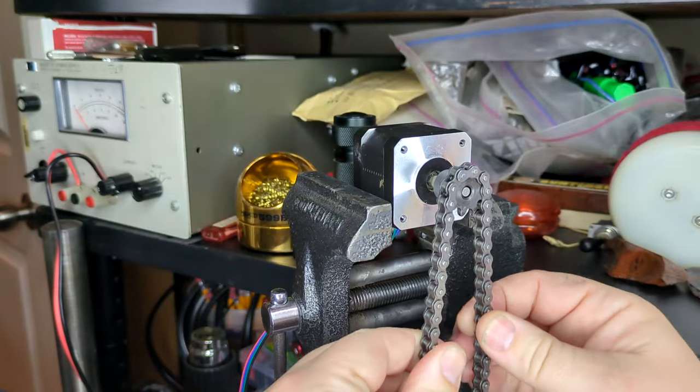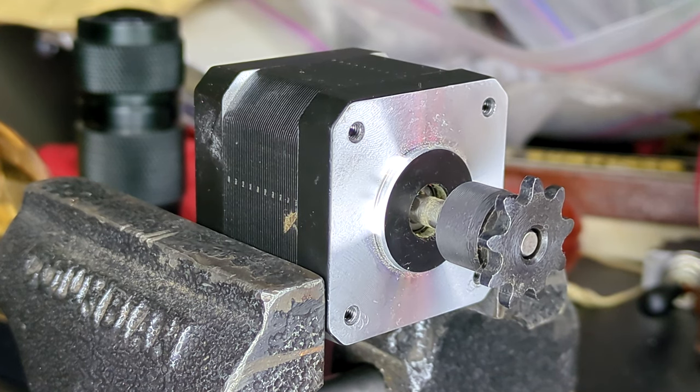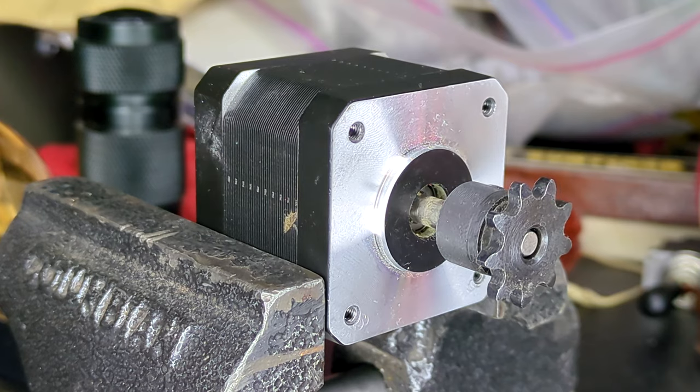Beyond just being pretty, roller chain would actually be ideal in this context. It can't slip. So as long as it starts in a known state, and you always rotate the sprockets by a known amount, then it's just some simple bookkeeping to track how much chain is where. Assume a basic microcontroller to do the arithmetic, and you could keep stuff moving back and forth indefinitely.